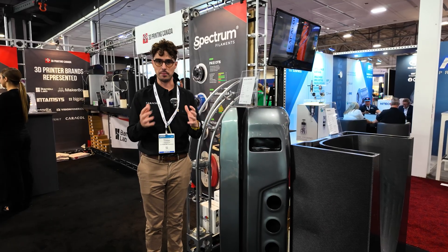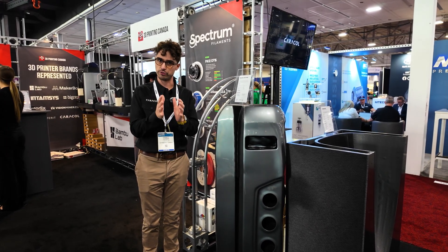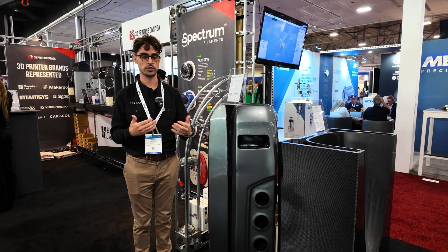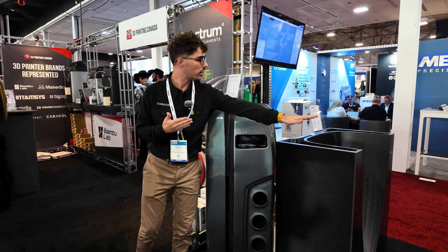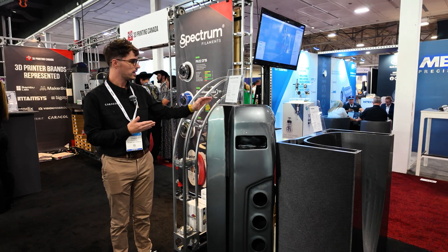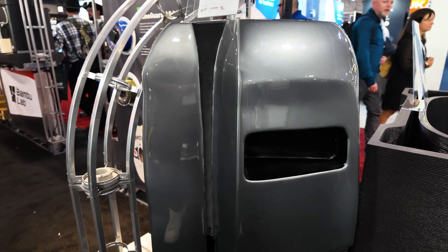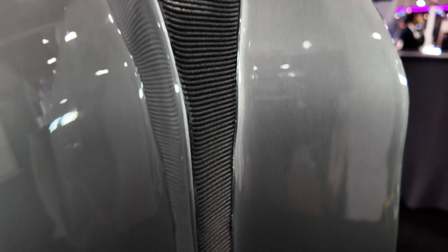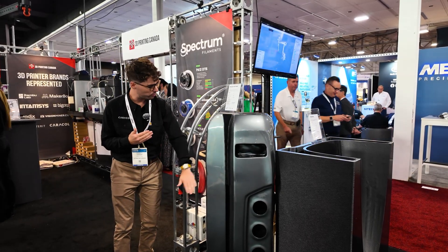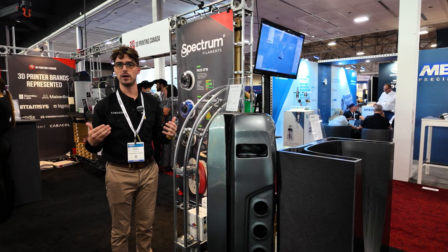This makes a lot of sense for customers doing short-run parts who need the tool quickly, so they can rapidly prototype anything from carbon fiber to trim and die tools, as well as large architecture facades or concrete formwork. Because we print large format parts, the name of the game is finishing. With large format, we're focused on large parts that we then finish to net shape afterwards — hitting it with an end mill and a five-axis CNC. We also have this mock-up for a rear tail light panel, finished with a traditional automotive process: ABS-CF hand-sanded, primed, coated, and painted to an automotive-level finish. This can be done for rear tail light panels, front panels for larger trams, car hoods, or car bumpers. It's really mind-blowing that we're at the point where you can 3D print something like a car bumper, sand it down, paint it, and use it as a production part.